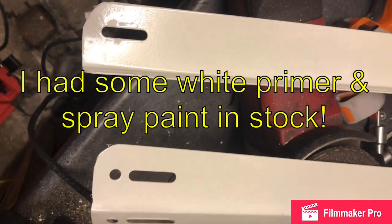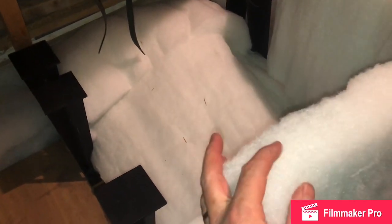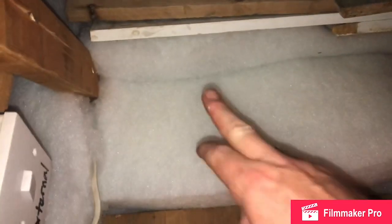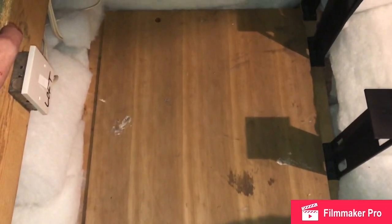The next step is to go back to the loft and work on the insulation. We're now in the loft and as you can see I've been working on it and managed to achieve one foot thickness of insulation — 300mm, in the region of that. I've got a roll left over, so my plan is to cover the loft hatch with it and I'm going to slightly oversize it, leaving a bit of a gap so it laps rather than butts. I want to insulate the loft hatch area to the same standard as the rest of the loft, or as close as I can possibly achieve.